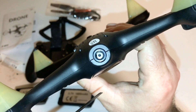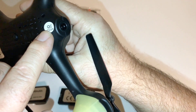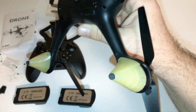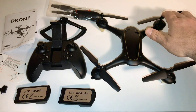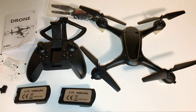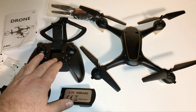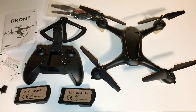The camera is just a little pinhole camera, so nothing too big — I'm not expecting too much. They confirmed it is 720p, so that box is probably used for every model. I'm not too sure how well the 4K model works. The Wi-Fi FPV is going to have some breakup because it is not 5G Wi-Fi — it is only a 2.4 gigahertz Wi-Fi system, so I'm sure we're going to have some interference, especially in my area.